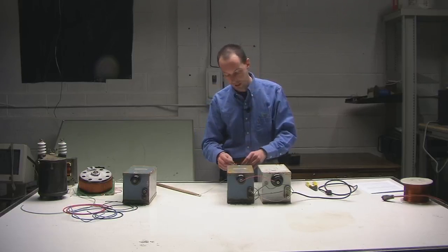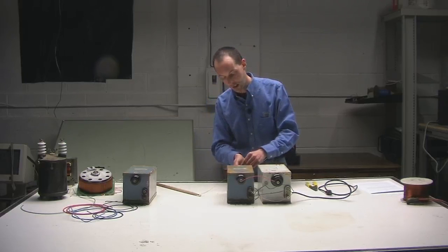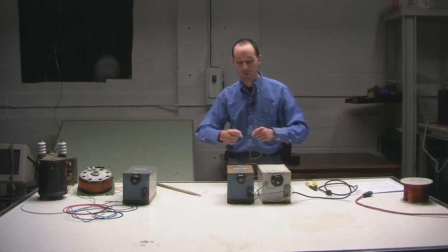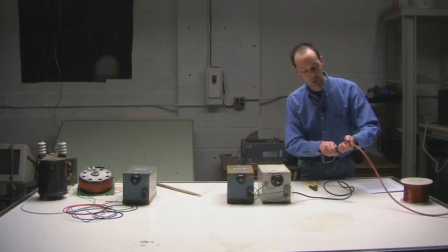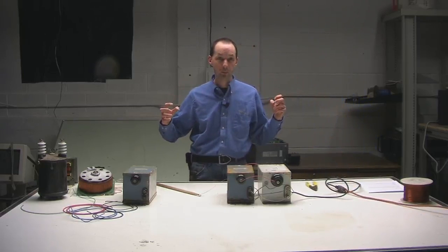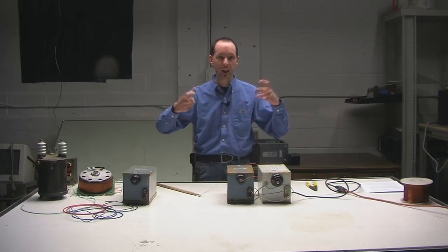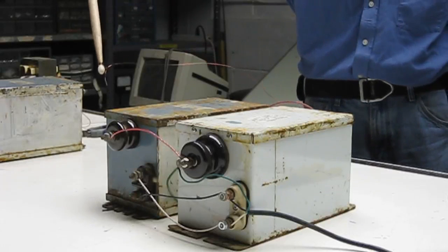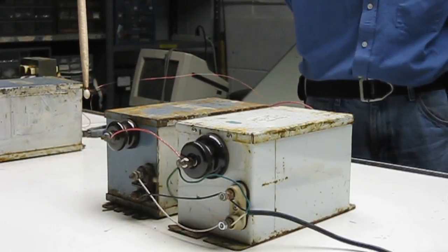And we'll go from 60 milliamps up. Because in arcs, how many amps you have equates out, when you're dealing with arcs and sparks, to how far you can draw the arc out. Now, high voltage sparks are loud, crackly, bristly arcs, like a Tesla coil. High current arcs are fiery, thick, hissy arcs. Now, watch this. I will do it right there. See how I can drag that out about twice as far now?